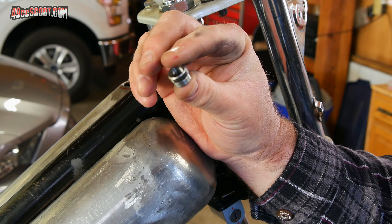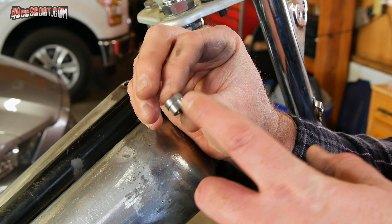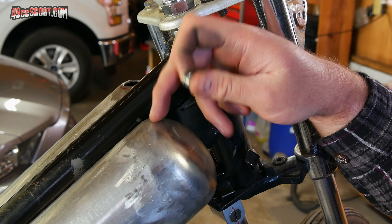For the connection on the second tank I've got another steel 1/8 inch NPT bung modified on the lathe so that this part fits into a half-inch hole, and I'll drill that into the very top of the tank.